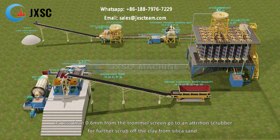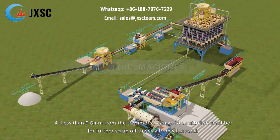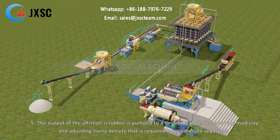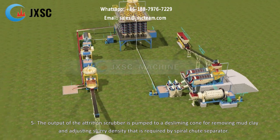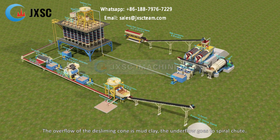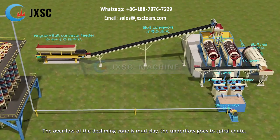4. Less than 0.6 mm from the trommel screen goes to an attrition scrubber to further scrub off the clay from silica sand. 5. The output of the attrition scrubber is pumped to a desliming cone for removing mud clay and adjusting slurry density that is required by spiral chute separator. The overflow of the desliming cone is mud clay. The underflow goes to spiral chute.